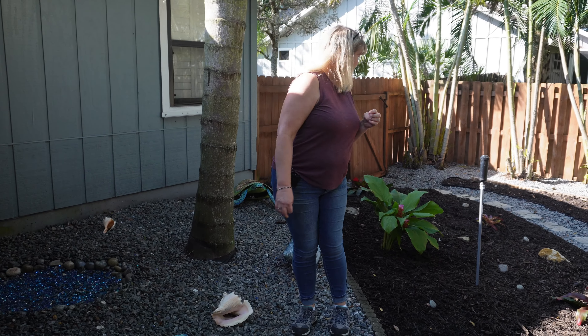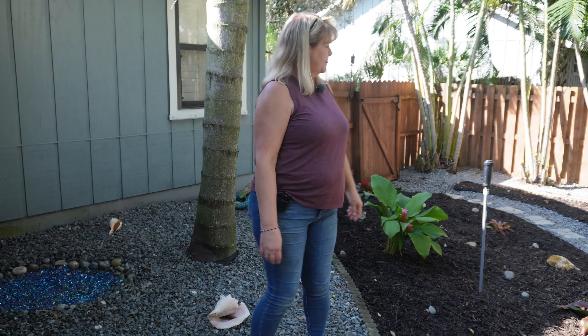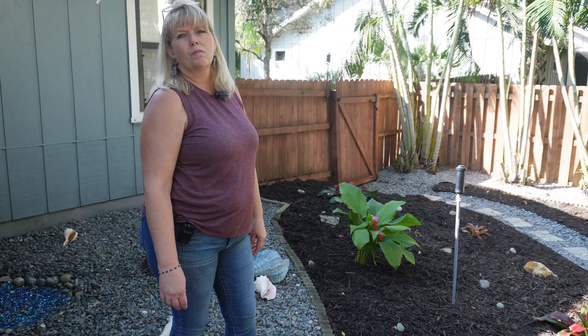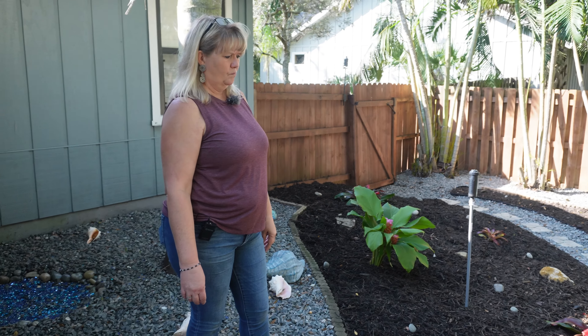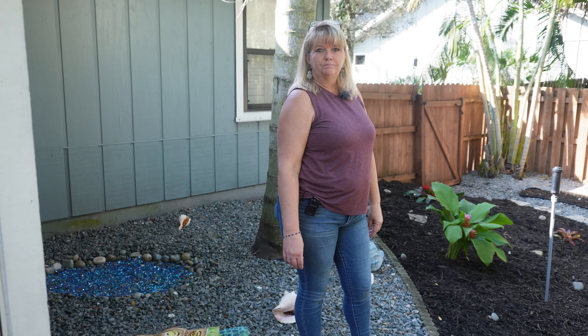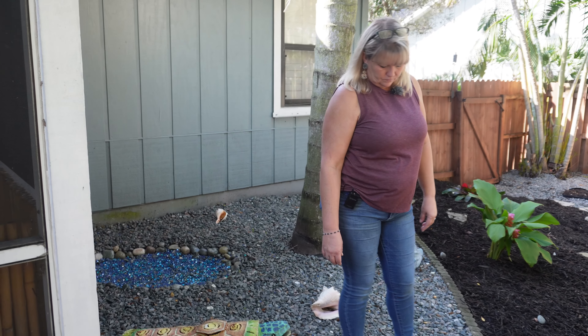This entire yard really is a drain field. It's got several layers — dug down eight inches in all the areas that you see rock, then packed in with crushed rock and sand. It's got the barrier material so that we don't get any weeds growing through. And then on top of that, we've got about three inches of mountain granite stone laid in.